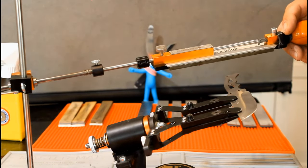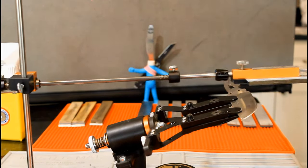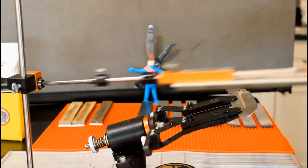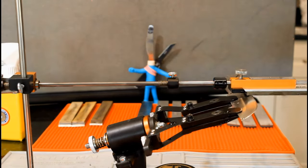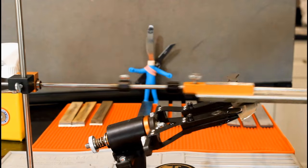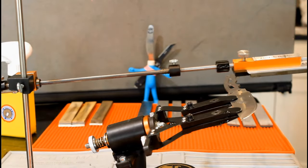With certain steels, the bevel will have a little shine at this point. The scratch pattern should be light, and more importantly for the mirror finish, it should be uniform. As we are going for a mirror polish, it will not hurt to use some extra cutting strokes here. This will be the last stone with at least some cutting power. Use this to erase as many gashes and scratches from the bevel as possible. Hell, let's give this titanium bonded gem 40 passes on each side.